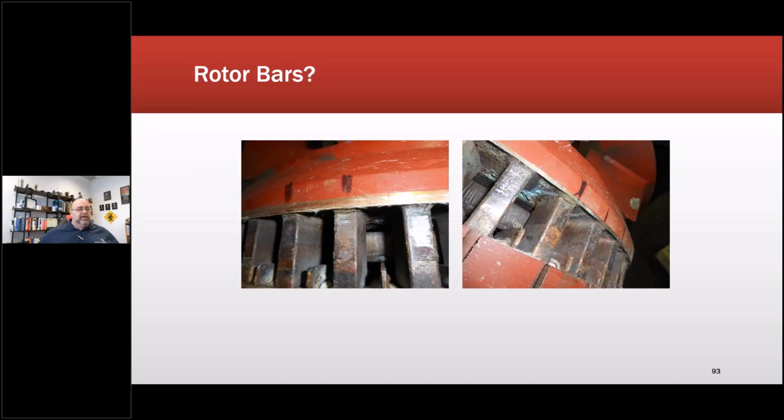Okay, let's see. Tan delta with transformer bushings, a few times that happens in motors. Yeah, we do run into that in motors. Tan delta tends not to be used that much in the electric machines that we're dealing with. It's not popular for machines, primarily cables in the US right now, so I don't see a lot of them. And then, do we get classic PRPD partial discharge patterns with surge PD? They're slightly different.